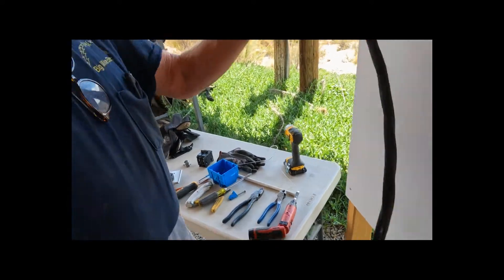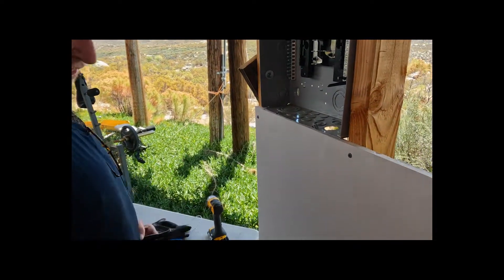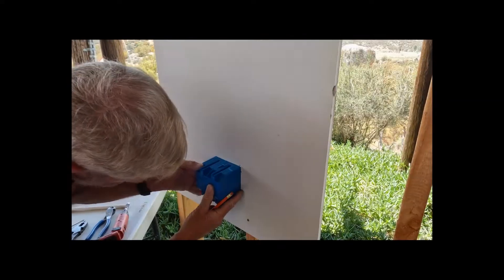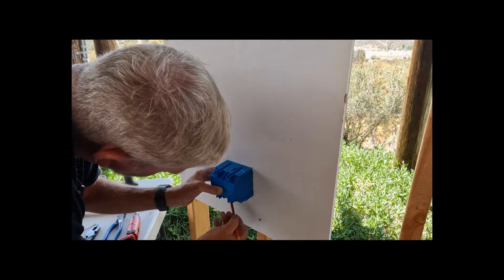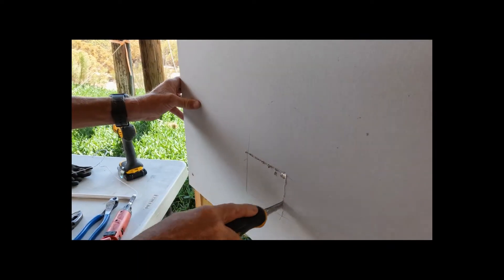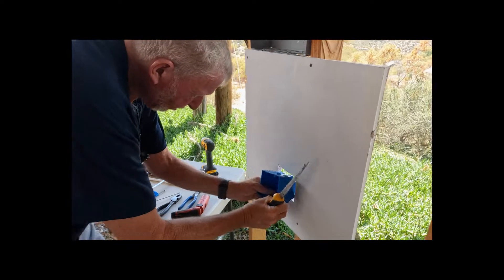I have a little bit of wire, so I'm just going to take the box and position it. I can see where the studs are, but I'm going to put the box down here. I'm right against the stud — use your Klein hammer. Imagine this drywall all the way down; this is a full wall in a garage. Try to get it level. Everything has to be level. Then take your drywall saw and cut it out.